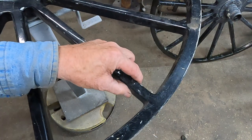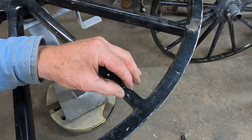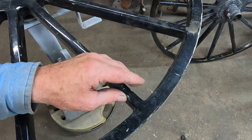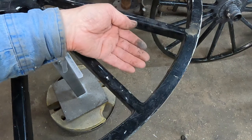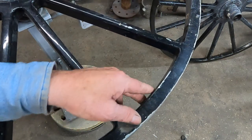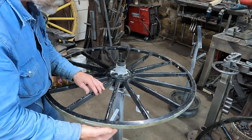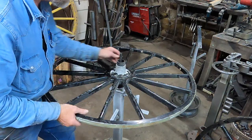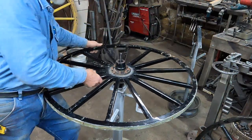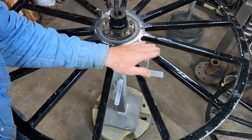Since these are a molded wheel, they have tapers to the inside of the felly and also tapers to the spokes. This top portion of the wheel, which actually will be the outside of the wheel when it's on the buggy, is the bottom side of the mold so they can be released from the mold. Turning it over, you can see the top of the mold — which becomes the inside of the wheel — is a little more square, a little more angular, and a little less cosmetic, but this becomes the inside of the wheel.